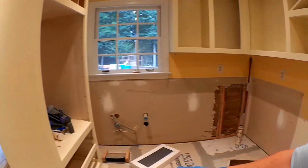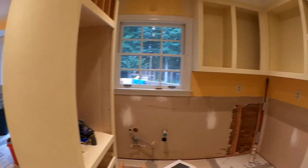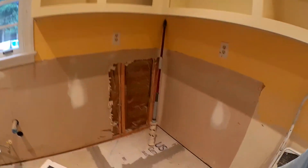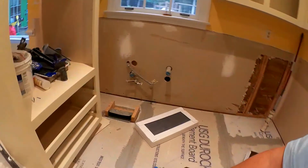Don't just pull one box and lay it down, because the next box may be a completely different color or a different variation or a shade off. So if you have natural stone, I would pull from a lot of the boxes, maybe 7 to 10 of the boxes, and actually take them out physically from the box and stack them. Grab one of these and stack it, then grab one of those and stack it on top, then grab one of those and stack it on top, that way you have a stack of tiles that you're actually utilizing that is a mixture of all the boxes that you've purchased. So that way the variation between the tile will be somewhat randomly dispersed throughout the floor or the wall, whatever you happen to be tiling.